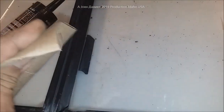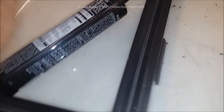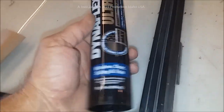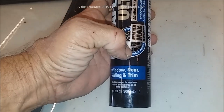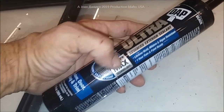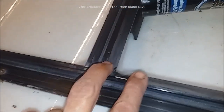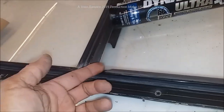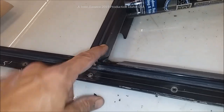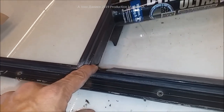Then you can just literally fill it in and take a profile — like a card or something. In my case, my profile is just going to be a paper roll piece, and I'm just going to go across it and it's going to look like the rest of this. It will stretch — that's what I'm going to show you here. This will stretch to fit, and it will continue. It has crack-proof Weathermax technology and will continue to stretch up to one third of its actual filler point. So in this case, if this were to retract another quarter inch — which is possible over five more years — as the chemical leaches out it does shrink, but this will keep it solid.